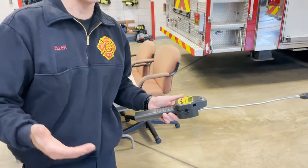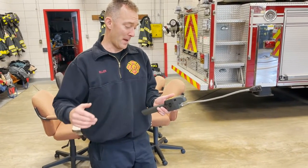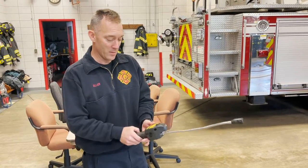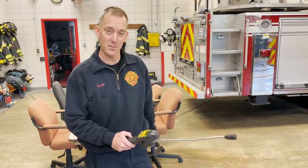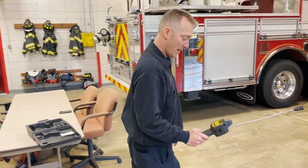Remember, natural gas is lighter than air. It's got a relative density of about 0.58, so it's only about 60% the density of air, meaning it's going to tend to rise very quickly. Give this time, just as with any other instrument or sensor you would use. Move slowly through the residence at about this speed.